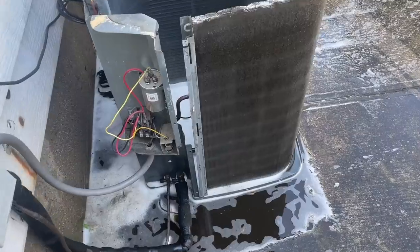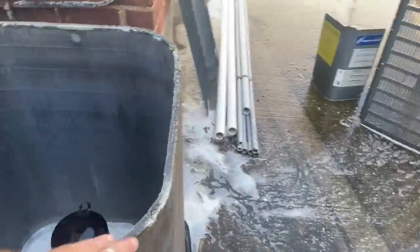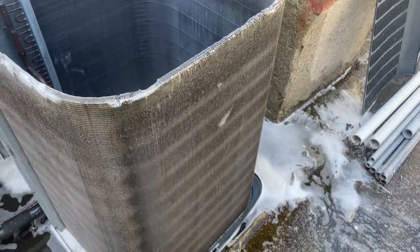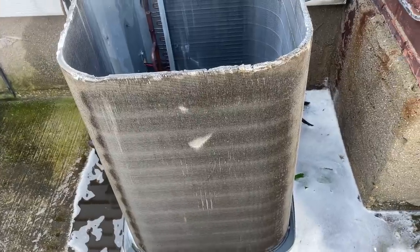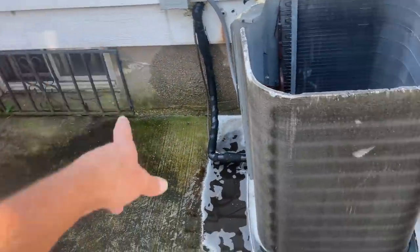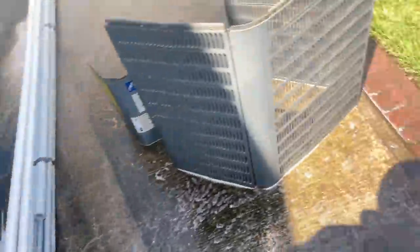Let's take a closer look at this coil — you're still going to have a little fine coating of oils or grease, but it's never going to be 100%. As you can see, it's a huge night-and-day difference. This side looked pretty clean when I was rinsing with water, but the water was light to dark brown at certain areas. It goes to show you it could look fine and clean but have fine particles of dirt between the rows of coils — and that affects performance. I've put the hose and shop vac away, just letting the area dry out and drain.